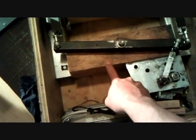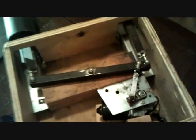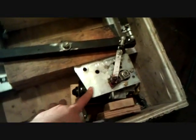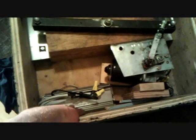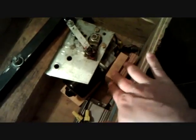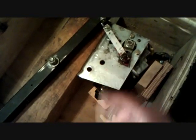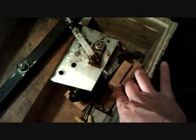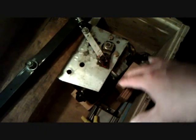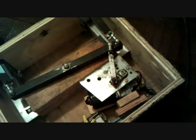This 4x4 block is the only original piece from the very first construction design. Basically I've got the windshield wiper motor and it is powered by an LED transformer that I had — it works at the same voltage and makes this thing work. These blocks jammed up in here were a quick fix — what I have it held onto the 4x4 with is a couple lag bolts and they keep working themselves loose, so I jammed all this wood in there. What really needs to happen is some through bolts through this whole thing. That's part of why I have this out and thought I'd show you guys everything.